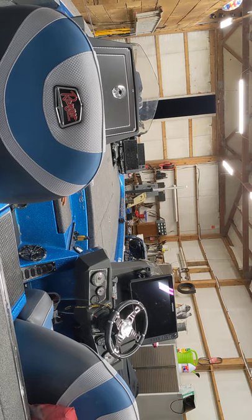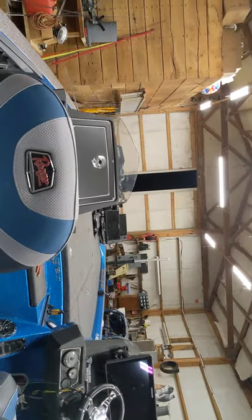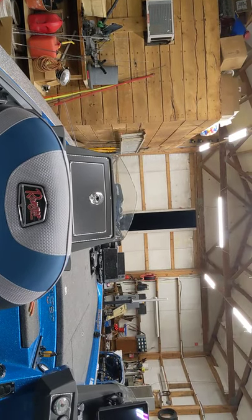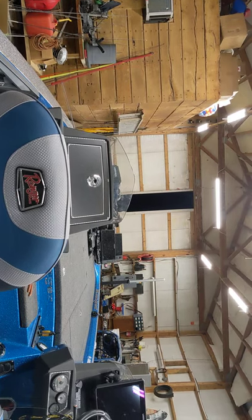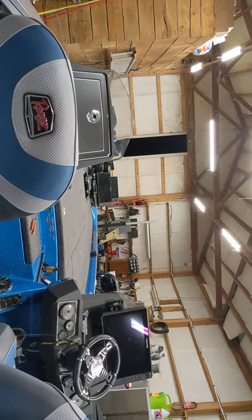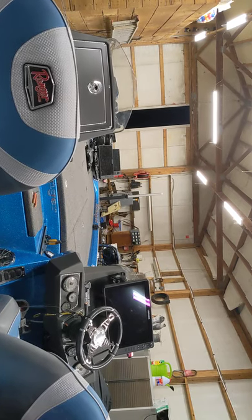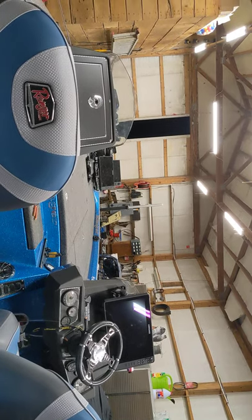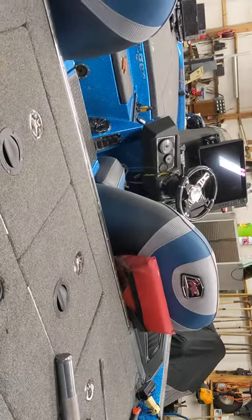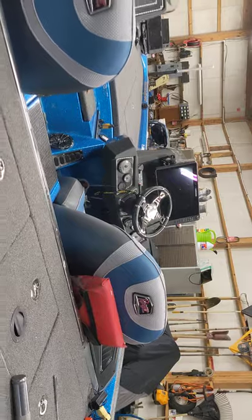The reason I'm doing that is because the factories don't run large enough wire for these big units we're running now. That's a 16-inch HDS 16 Lowrance at the console, another HDS 16 at the bow, plus a Garmin 1222 at the bow, and I'm losing voltage in that number 12 wire they run. If you have two units on and turn the voltage on for both of them and watch it — on this boat I've got between a one and one-and-a-half volt difference between the two units even though they're running off the same battery, strictly from line loss from the console up front. So I've got probably another half a volt or three-quarters of a volt lost from the console back here, so where my battery is showing 13 volts, I'm showing 12.1, 11.5 at the console, and they start kicking out on me.